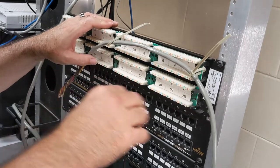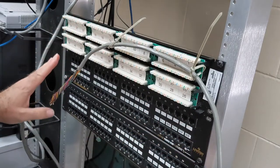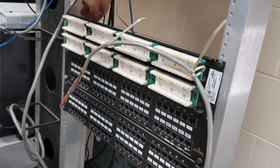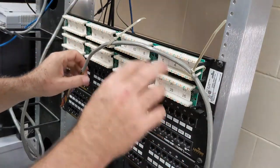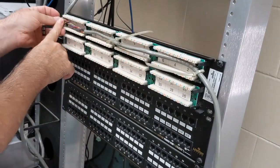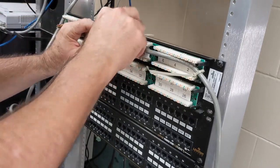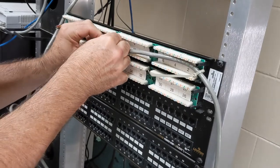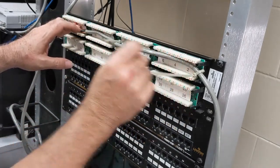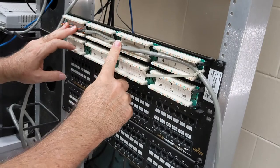As far as dressing goes, I decided to come in from this side, because when I flip it around that will put this part of the cable on the inside of the rack, keeping it more concealed. I'll cinch down here and leave enough slack so that my furthest pair — blue and orange — can reach. I'll put one in the middle, strip the cable back to the center, and pull the violets all the way back. So basically they'll do a hairpin from here back to here.